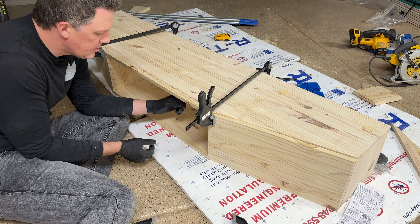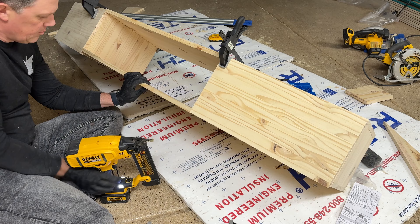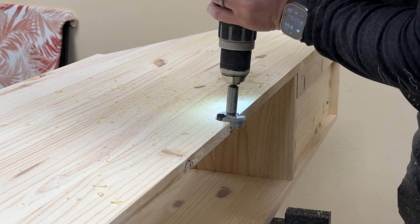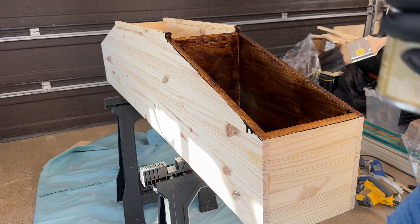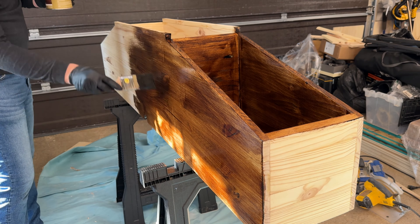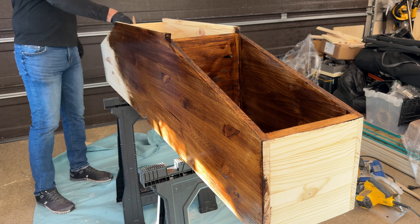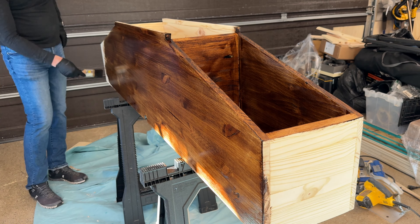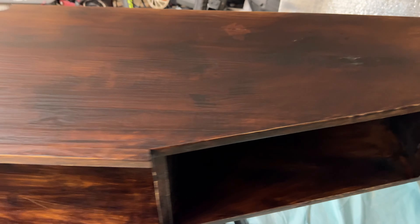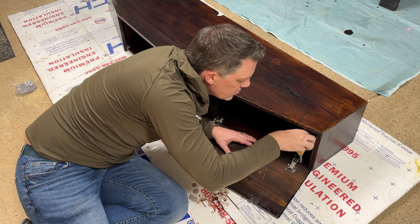I cut French cleats to hang the cabinet directly on the wall. I did some trim work on the front with hinging doors designed to hinge forward, making everything look flush. I drilled a hole in the back top of the cabinet for cabling so the soundbar could connect inside. I gave the piece a good stain after using a preconditioner on the wood. Note to self: I dislike using stain and sealer combos. Fortunately I was going for a rustic look — we have a ranch-style house — so it worked out, but I'll do stain and sealer separately next time.